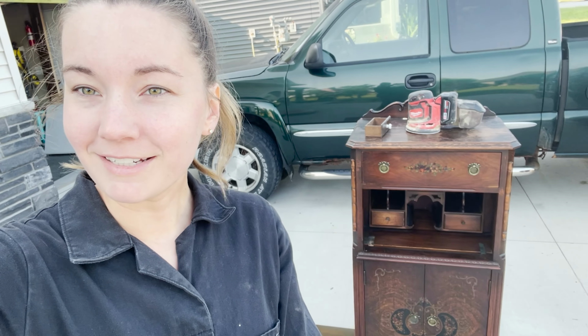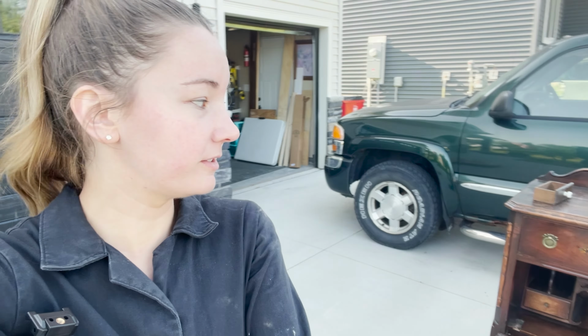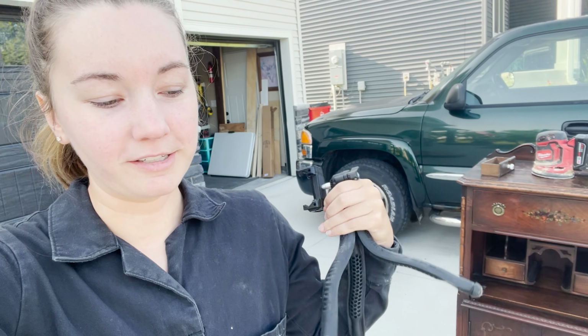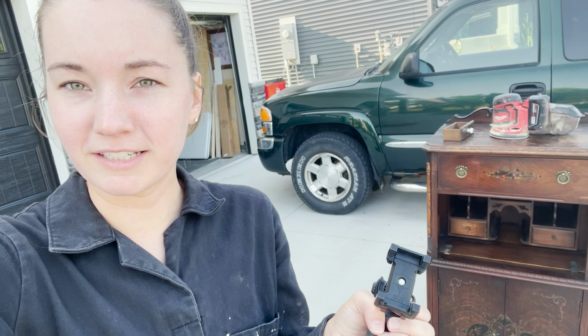We have a lot of sanding to do today for other projects as well, sitting over here. So we're gonna try to knock that out of the way so that I don't get stuck waiting on a project. I don't know if other people run into this problem, but if you start painting or putting a top coat, you can't sand for like a day because everything has to dry. The sanding causes all the dust to stick to that stuff, so you don't wanna do that. But yeah, we're gonna knock out all the sanding today, the worst part.